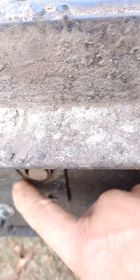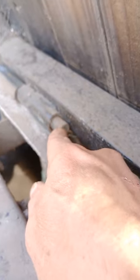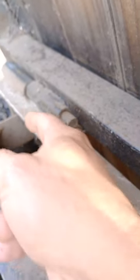I had to just extend the linkage. When I cut the other back end off of the mower, I made sure it had this bar, and then I just extended the frame some. The dump bed itself — if you just pull these pull pins and push this out, you can remove the whole dump bed if you want to use the stock little tongue on the back, like to pull a fertilizer spreader or something like that.